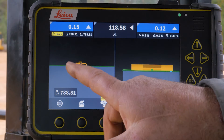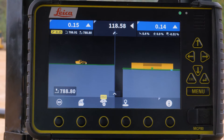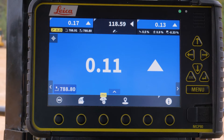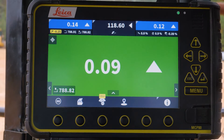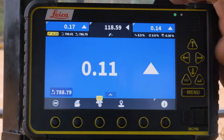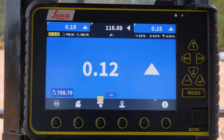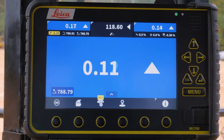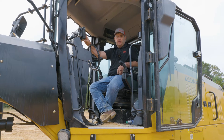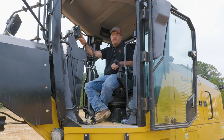We can do the three-finger swipe to get to a profile view, and again the cross-section view. If you don't like the swipe, you can touch the screen and use the arrows to page over. This is a great view when you're just mass moving dirt — I don't care where I'm at on the job site. I've got six feet of cut, five feet of fill shown across the whole screen: blue for fill, green for close, and red for cut. Makes it real easy for the operator. We want to keep the operator in the grade screen as long as possible — the whole software was written to give him most every tool he needs directly from the grade screen.